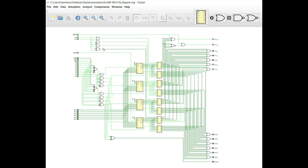So it's very versatile. You can write these pages to the registers, and then if you need to, you can read that data back and, for example, store it in another register internal to the CPU or in another place in memory. However you're going to store that, so that you know which page you're supposed to go back to, and then flip in a different page, either read or write information, do whatever you need to do in that second page, and then flip back once you're done. So it's very handy for being able to keep this data there.